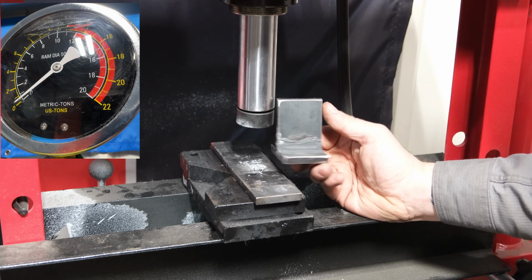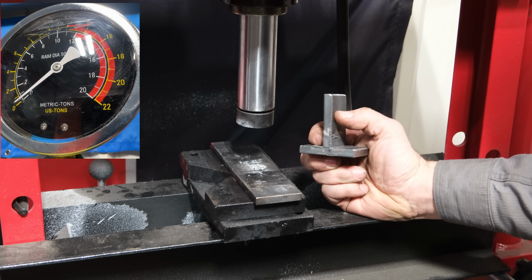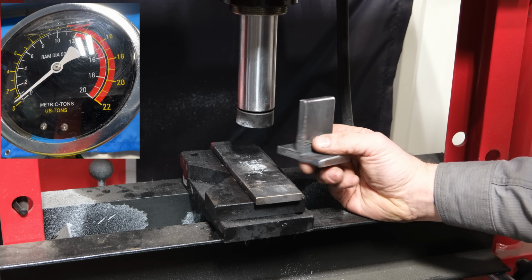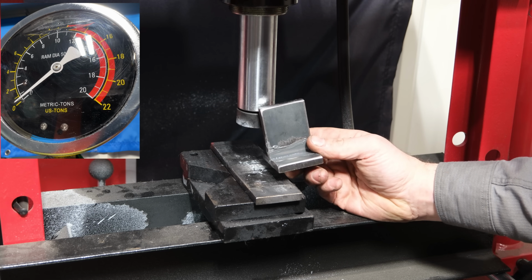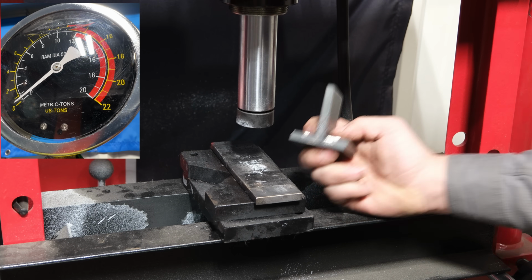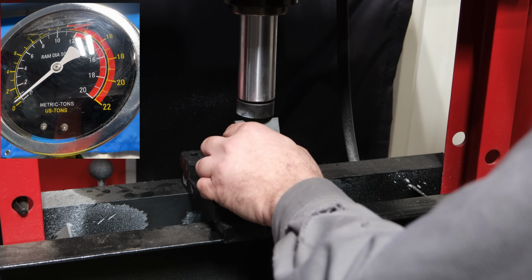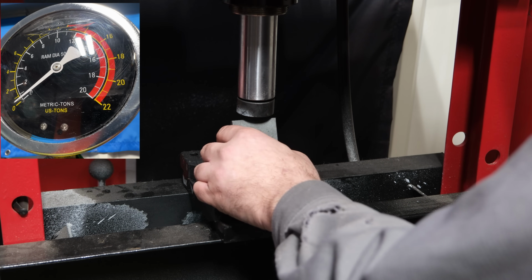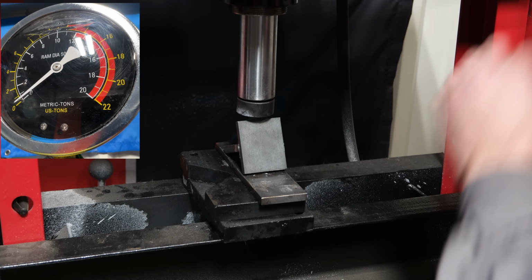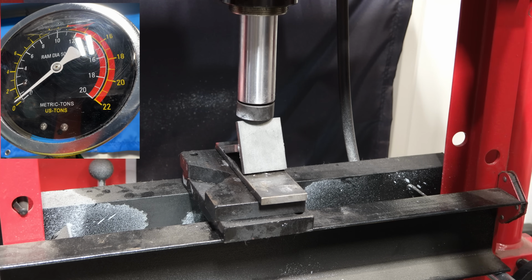Well, now we have the thin JB Weld, where it's basically just between the plates. And by the way, I did prep these as good as you can get and gave it a really good surface finish, aka rough, to try and get this to at least adhere. I have a feeling that this is going to perform about as bad as that poor, barely fused stick weld, well, spot weld on there, but we won't know until we try it. So let's bend this.